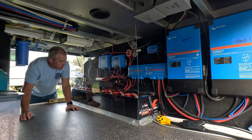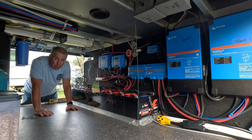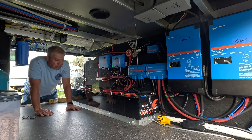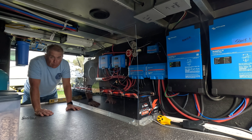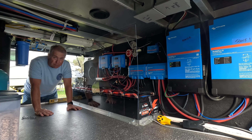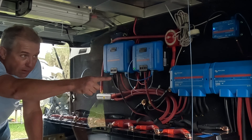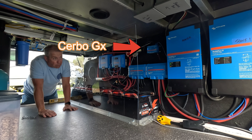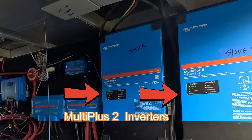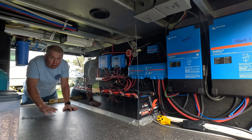That's how it runs — goes down to the solar charge controller. The only thing I had to do was run my own wires for the second set, which are the front four that you can see in the background. Well, here's the heart of the operation — as you can see, we've got eight 100 amp hour lithium batteries. The reason we went with the 100s is because that's what we already had, and I wasn't going to spend more money trying to upgrade. We would love to have two or three hundred amp hour batteries, but that's what we had, so that's what we ran with — it was a financial decision. We've got a couple of solar charge controllers, Lynx distributors, and over on the right of your screen are our MultiPlus Twos — we've got a pair of them hooked in parallel that will run our entire camper.